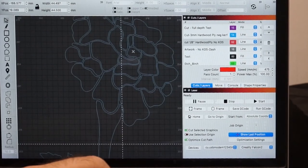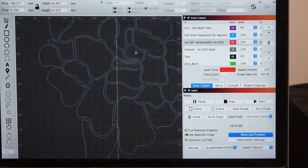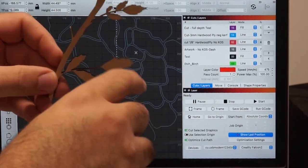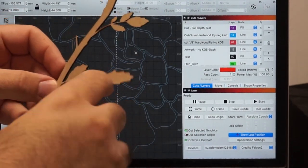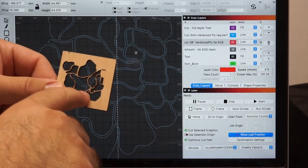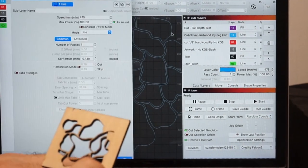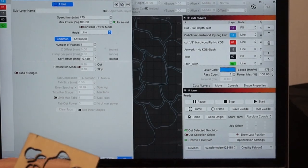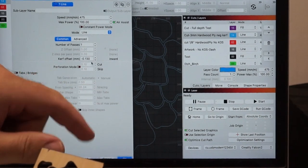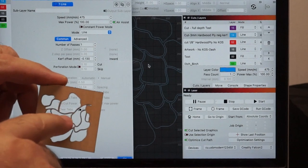One thing to keep in mind when doing these drawings is the width of the laser and how thin you can get the material. When I drew this, I wasn't thinking about that, and the gaps holding everything together got really thin. I cut out a test piece and you can see just how thin those are. In Lightburn, under your settings, there's a kerf offset — the kerf is the thickness of the laser. You can offset the laser so it cuts on the inside of your line by a certain amount, which makes all these braces thicker.